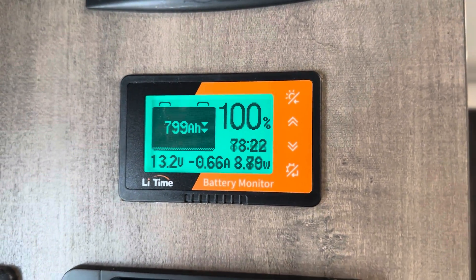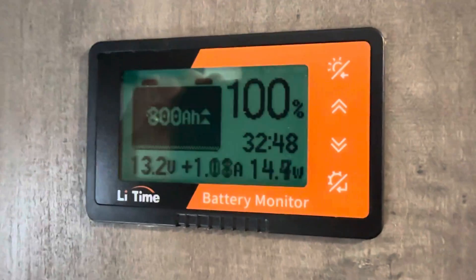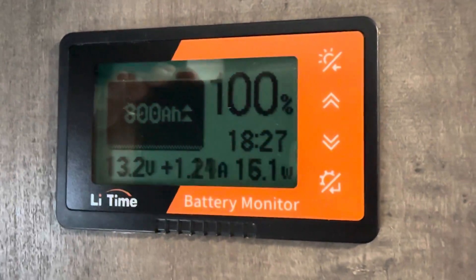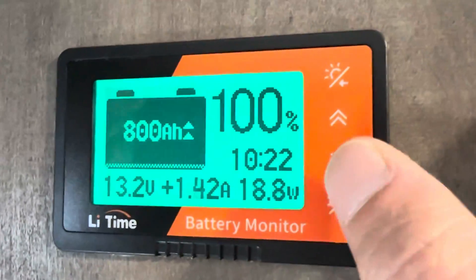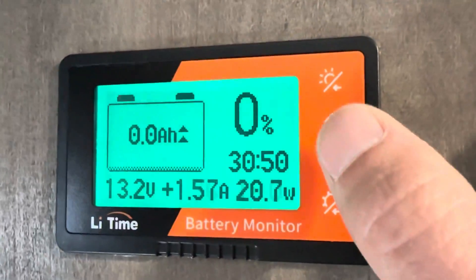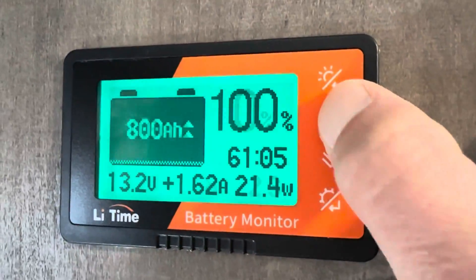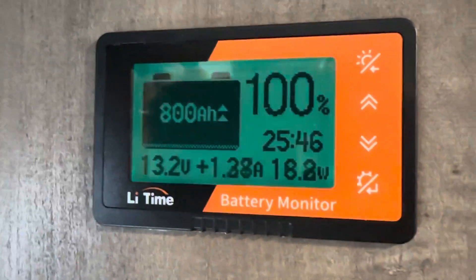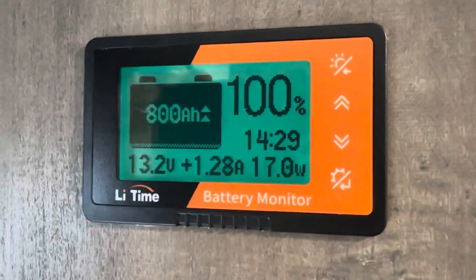I'll show you the shunt too. We can go over all the programming on this depending on what voltage battery bank you're using — just let me know in the comments. And yes, you solar nerds out there may see that it's showing fully charged at 13.2 volts. That is not accurate. When I was trying to do a display screen in between filming, I accidentally hit the top balance button. But you can just start over and let it recalibrate — put it back down to zero. It had to take a couple of days of cycling up and down to get this algorithm back because I confused it. I'll let it get up to float on the controller, then come back and hit the top balance button to show it's 100% again. So if you do that, no big deal — easy to fix.